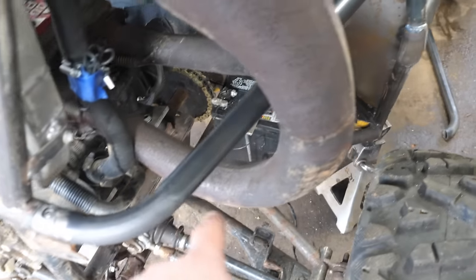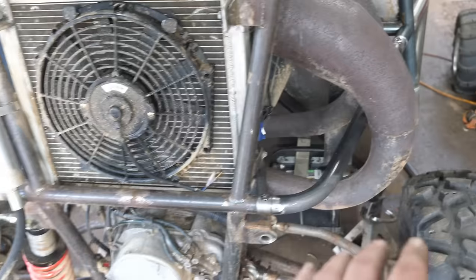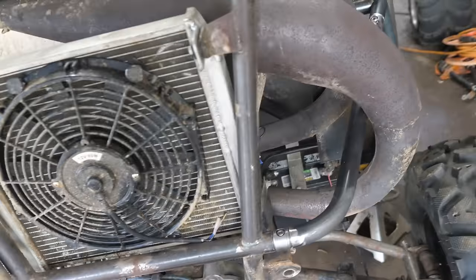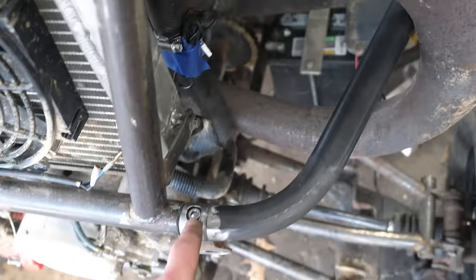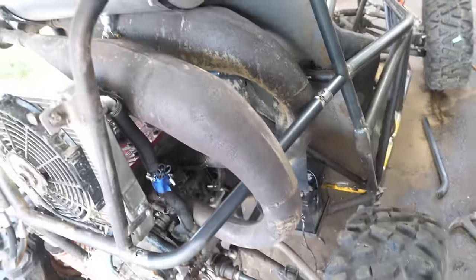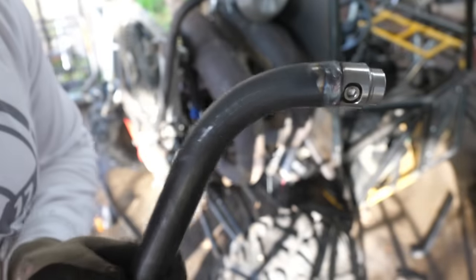Okay, so I went ahead and bent out a tube and I added these tube disconnects. I like how this side looks a lot better than how this side looks. And I added these quick disconnects here just in case I want to do an engine swap in the future or make this back section removable, or I guess for ease of serviceability. And also this old bar, the clearance from the tires was not really that good. Okay, so I TIG welded this bar.